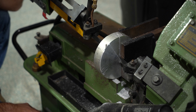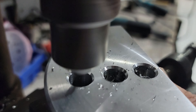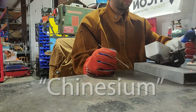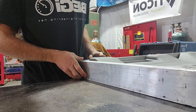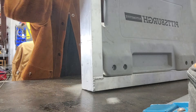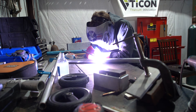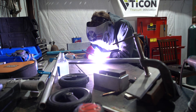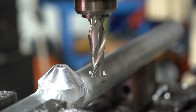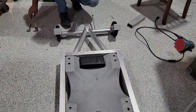At the hobby level you will often see random chunks of metal and just grab it and toss it in your ever-growing stash of metal you want to weld someday. But more than ever, as we import more and more Chinese goods, you will find a piece of 'chineseium' as Ave likes to call it - and who knows what alloys were used to create that random bed frame bracket you want to weld to a flower stand. Overseas they just grab whatever recycled scrap is laying around and toss it into the smelter, creating these weird amalgams. A new welder will try to weld this stuff and just not understand why it won't weld - it's magnetic, it grinds like metal, it looks and feels like metal, but whatever they put in it makes it unweldable. So if you're new to welding, you can save yourself some troubleshooting by making sure you start with a good known material.